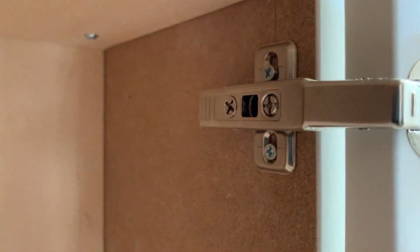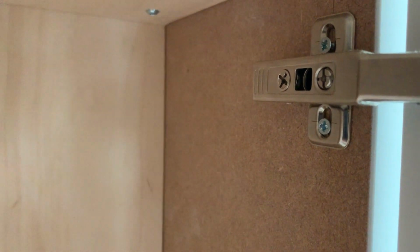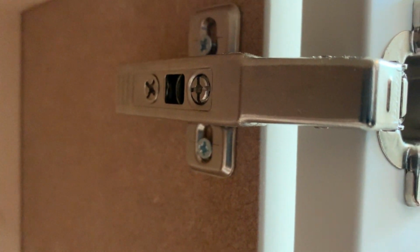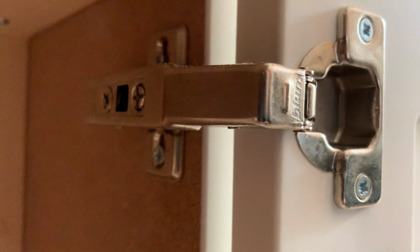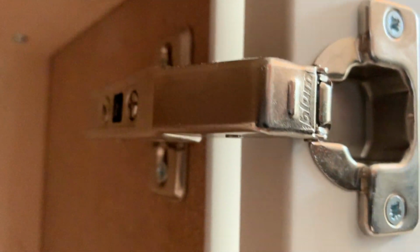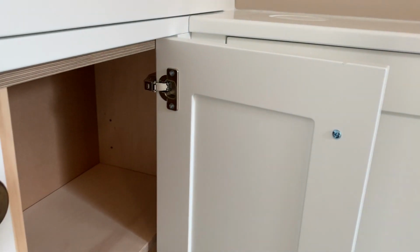The post hinge is a little bit trickier, but it does work on the same process, the same methods. But because the hinge arm is mounted in a different orientation to the door, the way things move will be different, but you get the hang of it. Something that can catch you out on the post hinge is that the setback from the carcass edge, from here to the drilling position, is 21 millimeters, not the standard 37 millimeters.